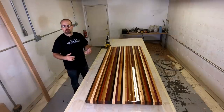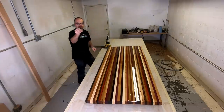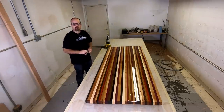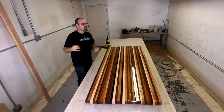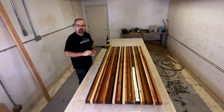We use a burn-in stick. We actually have pieces of our burn-in stick. We use these all the time. They look like a giant coloring crayon. And you can get them from a company called Mohawk. We have a link on our website to the actual burn-in sticks that we get. You can get whatever color you'd like. And then this will fill these little tiny problem areas.